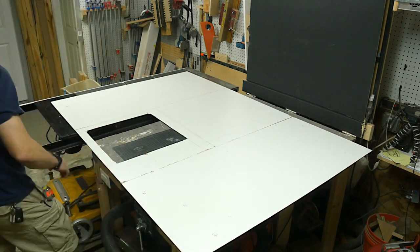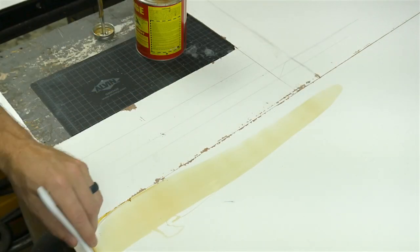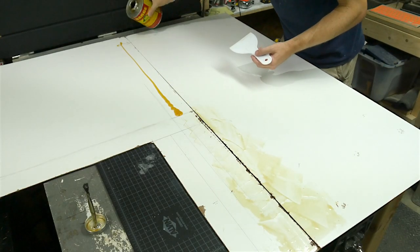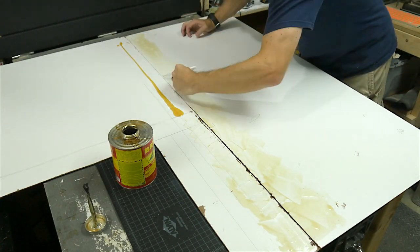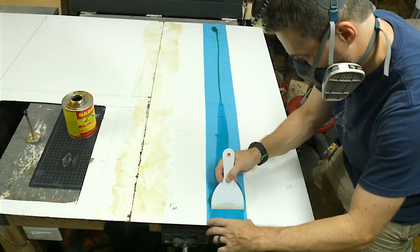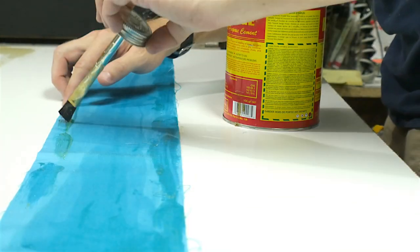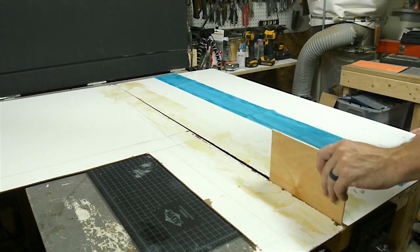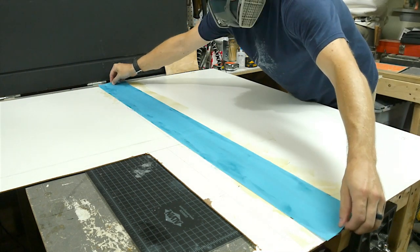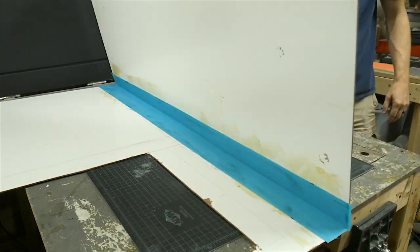I lined up the panels and then used some barge contact cement to attach the hinge. This goes on two surfaces and once they touch, they lock together. The first surface is this white area — you don't want these two white pieces to touch each other, you want to cover them with the hinge. As I was covering this area, I realized how much cement I was going to have to use to make all these hinges, so I decided to finish this one but not use barge for the rest. I covered the fabric and the melamine and let them both dry for about five minutes, then used an 1/8 inch piece of wood as a spacer between the two panels and laid on the hinge. As soon as these touched, they bonded — so I immediately had a workable hinge.